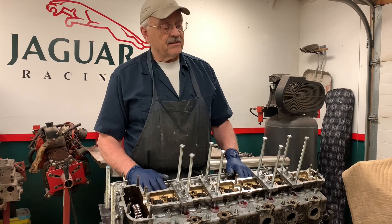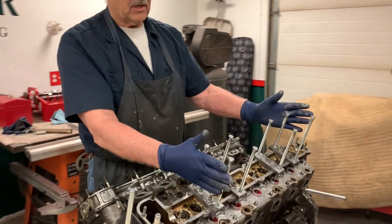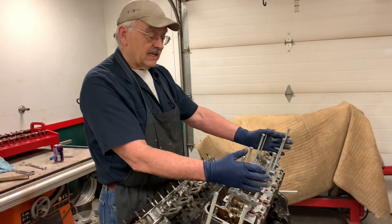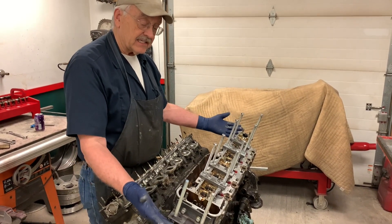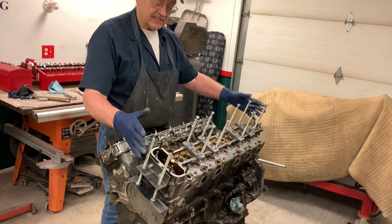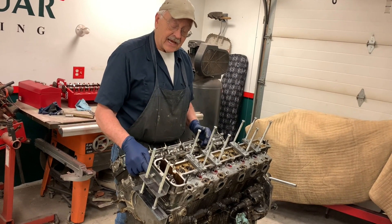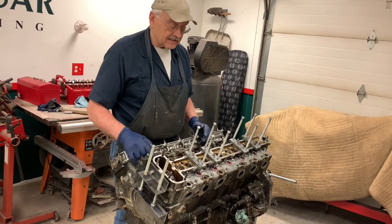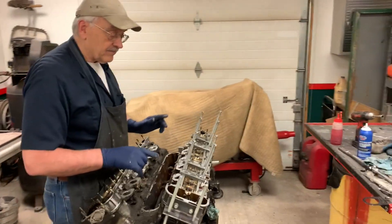The normal way that these heads come off is you've got a couple of pullers, one here and one here, and you just sort of go back and forth making sure that the cylinder head is coming off evenly. Because if you get this thing misaligned it can jam it on really tight. So you need to really make sure that as this comes up, the gap between the cylinder head and the block is even all the way around.